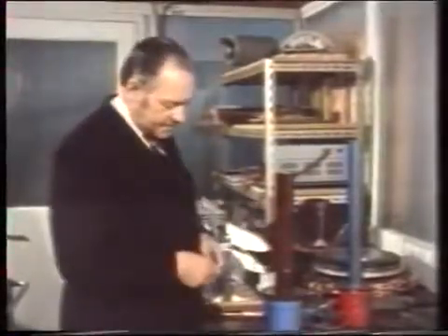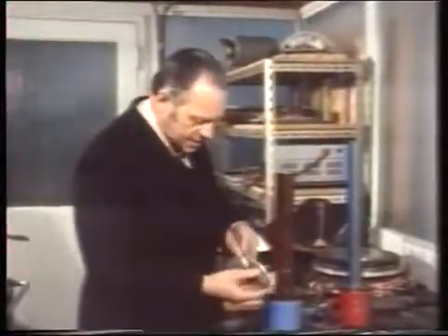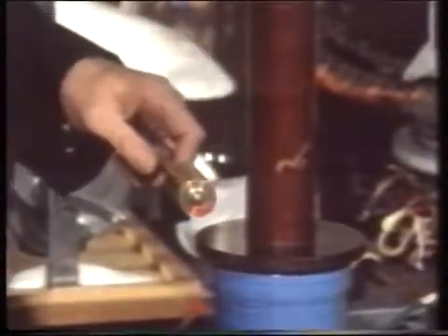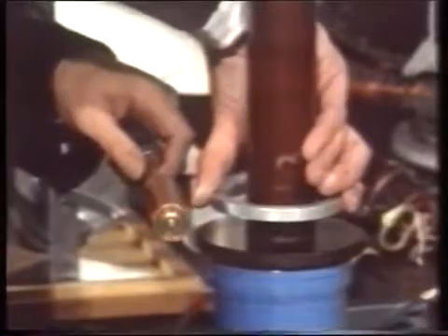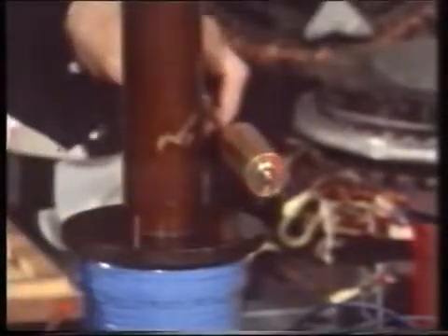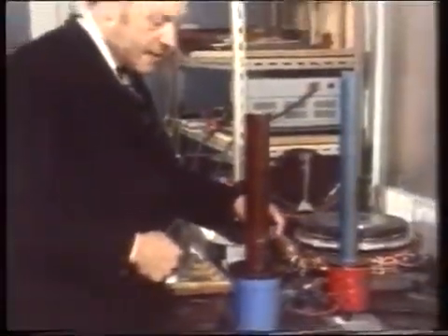Now what is the secret of this amazing device? This is a copper cylinder that is free to spin. If I hold it alongside, there's nothing much going on. But if I take this ring, which wants to float up there, and I force it down alongside the copper, then the copper begins to spin. And if I put it on the other side, it spins the other way. It is as if there was an upward-sweeping something — and we call that upward-sweeping something a travelling magnetic field.